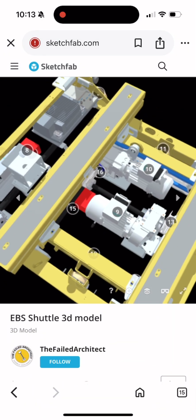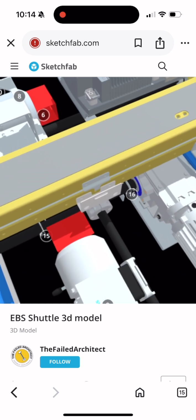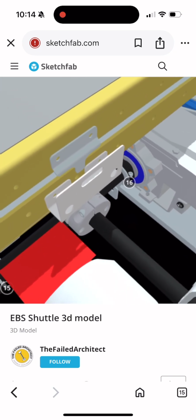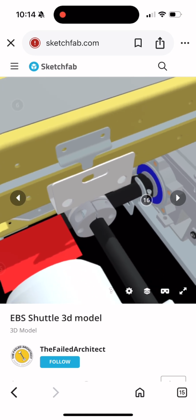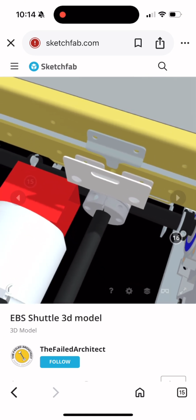The only way this machine has precision is by having sensors. Let's start with the fork frames and how the sensor works. It uses a proximity sensor in the middle of the fork to determine whether or not the fork is centered. This is the most important sensor because if the fork is any distance out to the left or the right, it could hit part of the rack and just completely break itself.